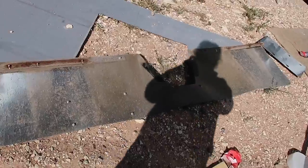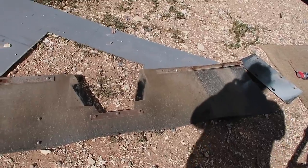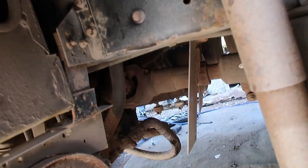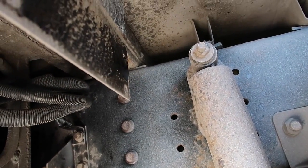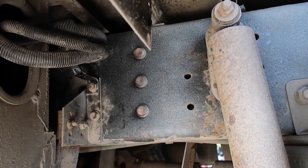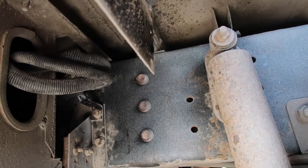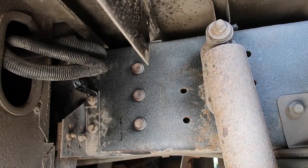I've got this single piece mud flap out of here — that was quite the trick. Now I have much more space underneath here to work. I'm going to have to put the leveler right behind this shock, so I don't have a whole lot of space for welding, but I can now get in there, grind it off, and weld it on. I have sanction and permission to weld on this frame — some frames you can't weld on, but this one you absolutely can.